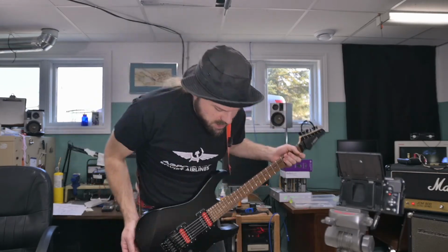Okay, so the 6N6P. Now, based on some of the research I've done online, we would have to do some recalibration to the amps to get the most out of it. I believe the tube is sounding thin right now because it's not set up, biased, calibrated properly for that circuit. Most of the circuits use a lot less than the value of anode resistor that we typically see in the preamp circuits of a guitar amp. So, being the kind of tube it is, it probably could be set up to be like an awesome sauce phase inverter for a guitar amp, but it might require some adjustments.